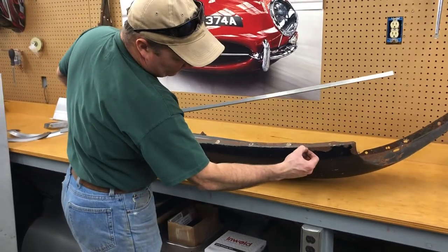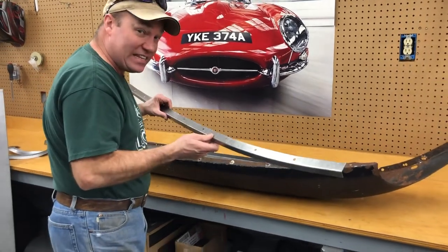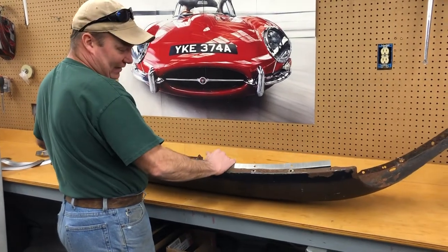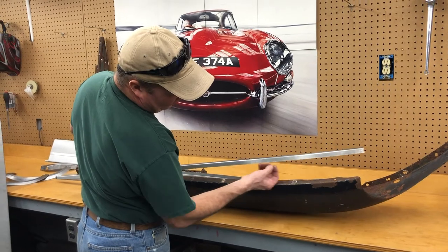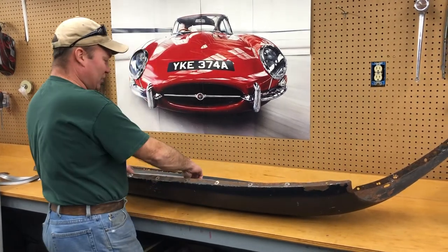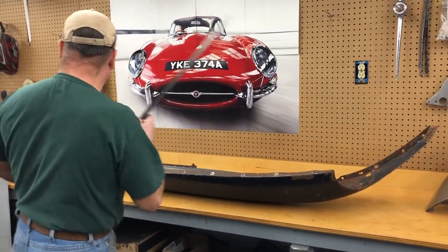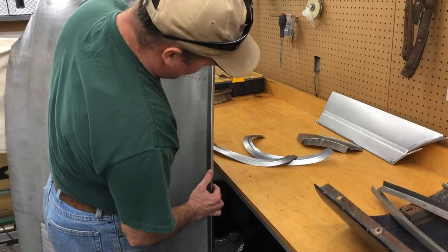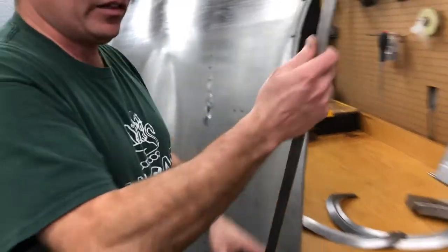You can cut this off right on this edge and then double it up on the underside. In fact, we sell a lot of these to big E-type restoration shops. What they do is put this on the underside, doubled up, then tack it. It's laid over like that — they tack along this edge, they tack on the inside along this edge, and then they put a little filler in there. There's a lot more filler in the big restoration shops than you think. We have a full set. You can order one or you can order the full set of four. They're always a dead match. Here is the one for here — made extra long. You can see how that's a real tight angle. It fits in there. So that's what we can do there.